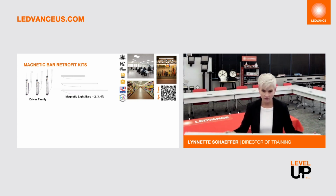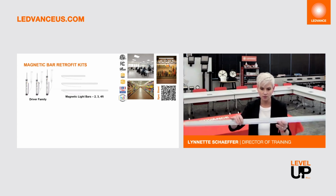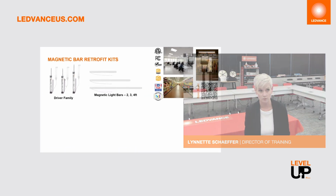When you have the lens off, this is what it looks like. So you can just basically see the LED chips all lined up right here. So that's the difference between whether or not you need to have the lens on or not. Now, if you're using this in a troffer with the lens installed, it does achieve DLC Standard. So another important aspect is just knowing whether or not you need DLC Premium or DLC Standard, and whether or not you need to remove the lens.